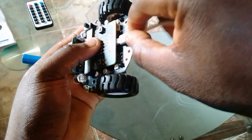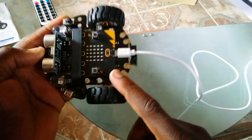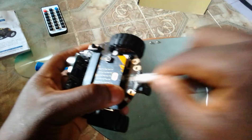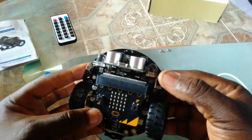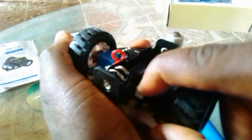Anytime you want to write a code, you need this USB cable. Connect it to your micro:bit carefully like this, then send whatever data you want to upload. Once you've sent the data you can disconnect, but please be careful when connecting and disconnecting so as not to damage the terminals. Once you've sent the code, just power up the robot car and it begins to function. I'm going to connect the battery now — that's fairly easy — and I also forgot to connect this, so let me do that now.